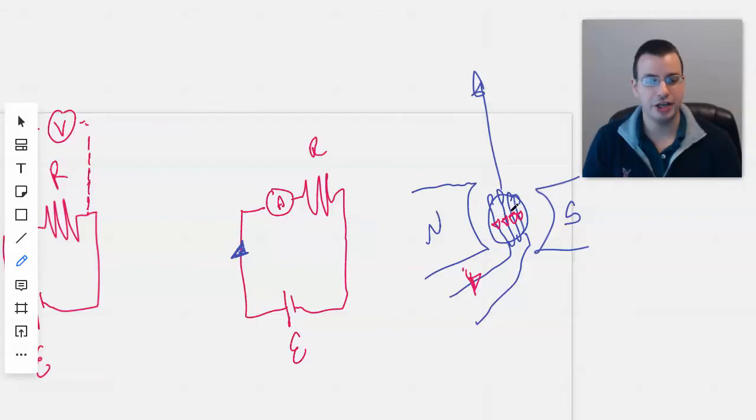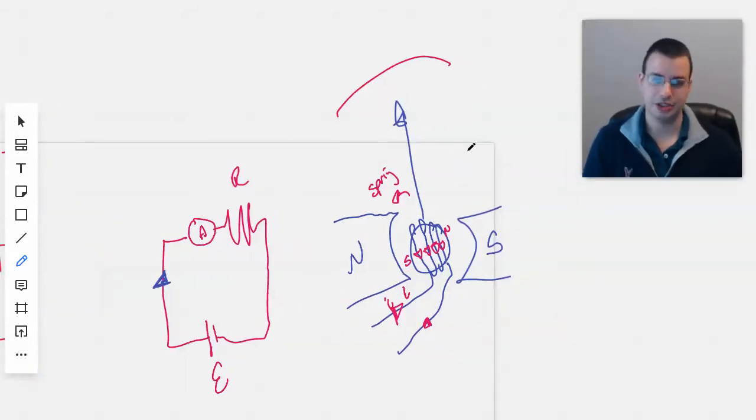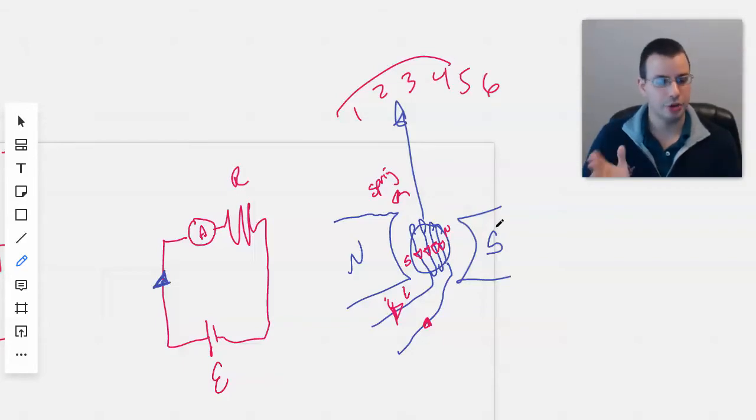And so, in effect, what you've done is you've created an electromagnet out of this thing in the middle. And if it's free to rotate, and you put a little spring on it, so you get a little spring force going this way, what happens is current flows through here, creates an electromagnet with north-south, and it's going to want to align itself with another magnet on the outside that's also north-south. And it turns out, we'll talk about it later, for an electromagnet like this, the strength of the electromagnet will depend on how much current is flowing through it. It depends on lots of other things as well, but it'll be proportional to the current. And so the more current you get, the more it's going to align with this other magnet. These are just numbers to show that it's a meter.